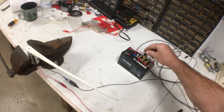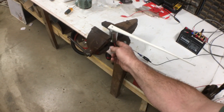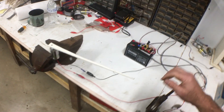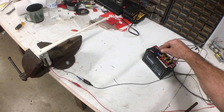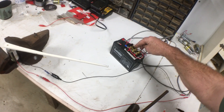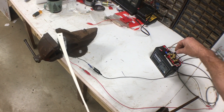Over here I have another battery set up with a switch and a couple jumpers which will reverse it, hooked to this motor. This is the same motor used on every part of the suit except the backpack. So one position, one rotation — counter clockwise — flick of a switch and it's going clockwise. This is the exact type of setup I use on the suit to reverse the motors.